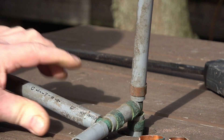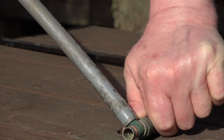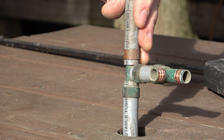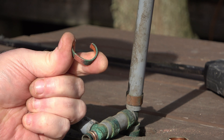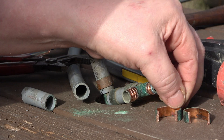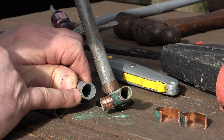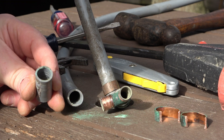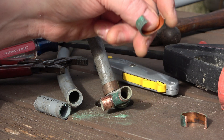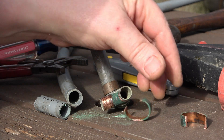Let's remove one of these rings. Look — it's turning. You can see the copper on the inside, it's still shiny. A little bit of copper showing on the fittings. You can see the furrow marks on the inside of the pipe, but the pipe does not look distorted. This system is in great shape. However, if one of these fittings failed, the pipe would fail — but there's no sign of failure here.